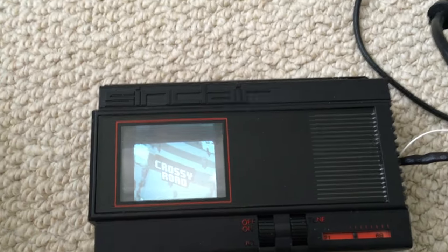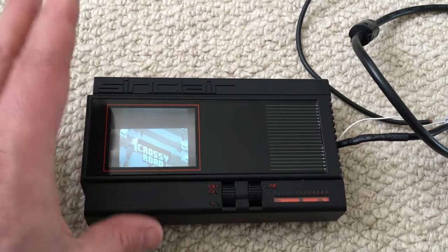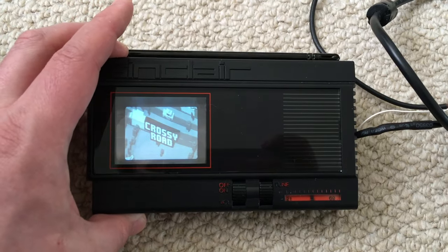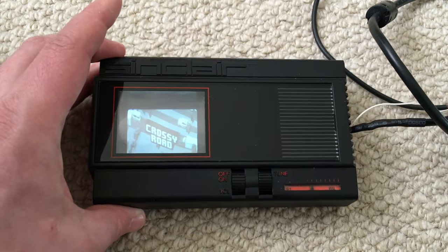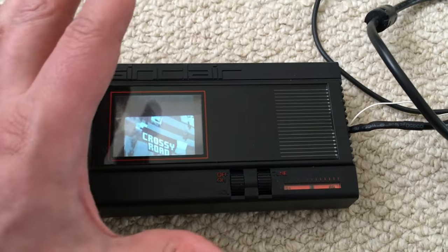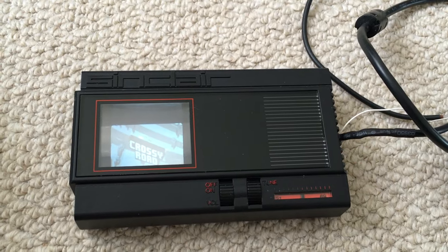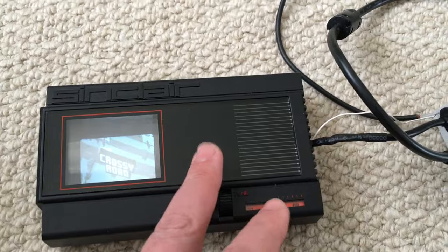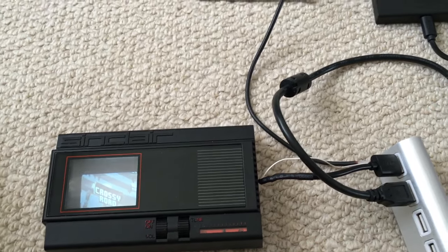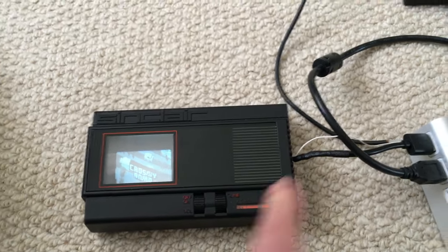It made for quite a compact unit. This one was sold as untested — in quote marks — which made me think it really wasn't going to work. But actually when I opened it up and powered it from a power supply it worked absolutely fine, or almost fine. I got a bit of static on the screen, but when I tuned it into something the screen shrank to a tiny bar. That was fixed by adjusting some of the internal trimmers. While I was in there I noticed it would operate on 5 volts, so I brought out the battery contacts and wired in a USB plug on the end to supply power.